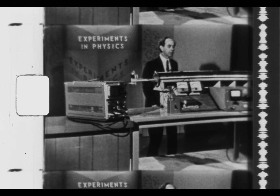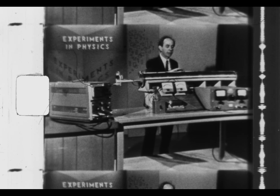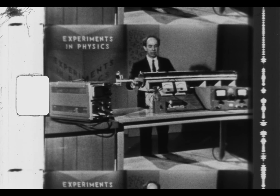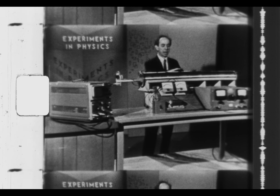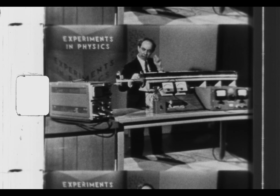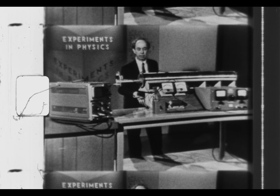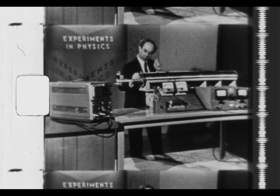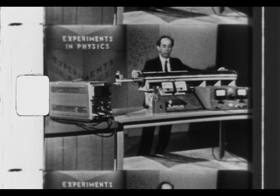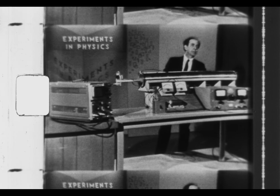In this experiment, one can study the electric field which is produced by a changing magnetic flux. Magnetic flux is produced inside this long solenoid, which has three layers that can be connected either one layer at a time from here to here, or all three layers in parallel, which is the way it's connected now. If one wants to have just one layer, one removes some of the straps on this end of it.